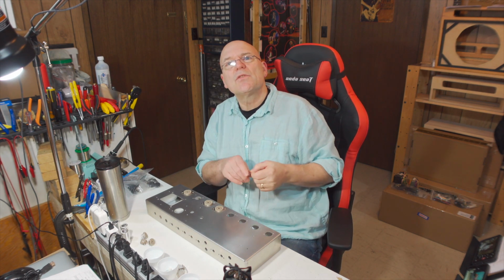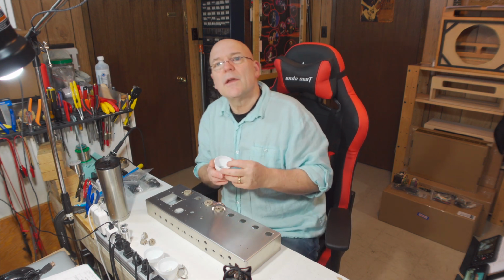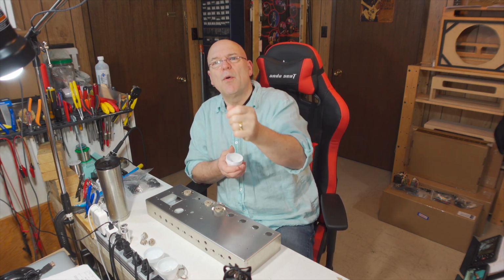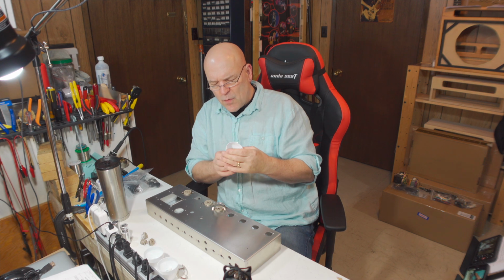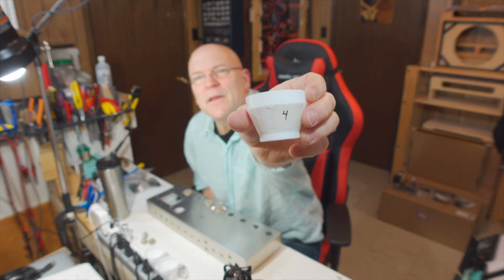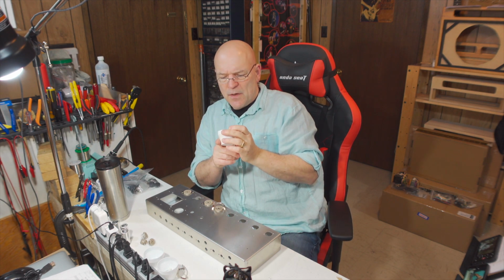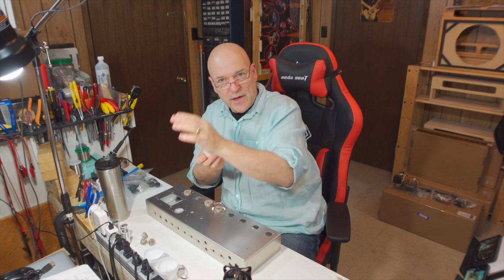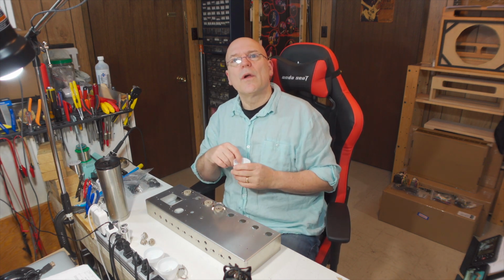Before we put the machine screws in, though, we also need to make sure we put the retainers over the tube sockets. Oh, and this is another thing I was going to point out. One thing I like to do, you've probably seen, and you will see in this build, is that I use a piece of foam and I put all my components in the foam and then put a strip of tape labeling where the components are just so I can grab them easily. I never thought of this before, but I took all of the mounting screws and things, and you can probably see, maybe you can't, that it says it's got a number 4 on there. So I took all the number 4 screws, hardware, lugs, nuts and things like that, and put them in a container. I put all the 6s in one with a sticky on it that says 6, and I put all the 8s in another one, just again, so it's easy for me to just grab. So another little tip for making your workflow quicker when you're working on amps.